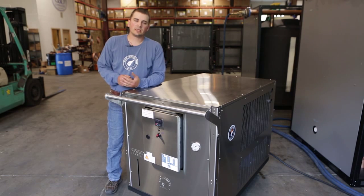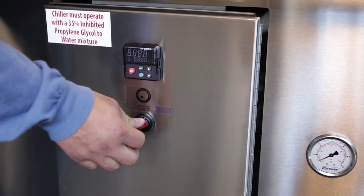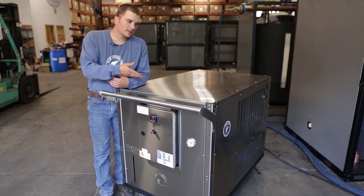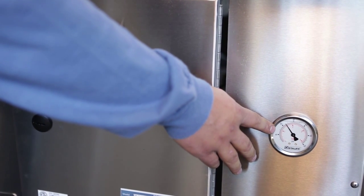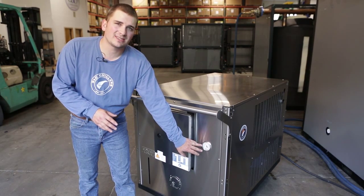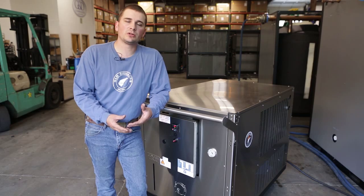Next, it's time to turn the machine on. We can verify glycol pressure and pump rotation at that point. All you've got to do is turn the machine on. You're going to see the thermostat light up. You may hear a compressor, or it might be in heating mode depending on the ambient temperature and glycol temperature when it was mixed. Verify glycol pressure on the pressure gauge — it should be at or right around 20 PSI, which is our factory setting. If you see very low glycol pressure, it might mean you have an airlock, or on a three-phase system, your pump may be spinning the wrong direction. A certified electrician can help you figure that out.